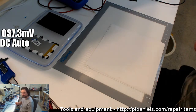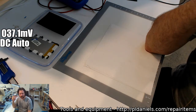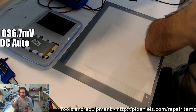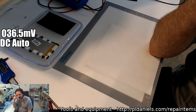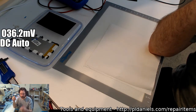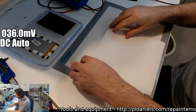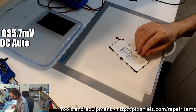With the HP, we've got the glass off, the touch glass. That was a pain in the posterior. I've got to get some tape for it to put a new one on. And then the hinge arm. I thought it was a broken hinge inside the laptop assembly, because I've got so many of those happening. But it turns out it was actually the metal arm in the screen frame that had snapped, so that's where the issue was. So I'm going to have to order the tape and the new arm, and then I can get back to it.